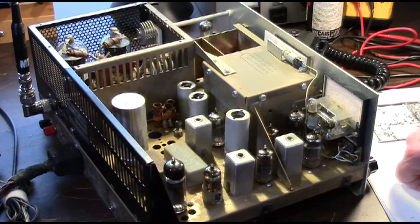So if you're having a mysterious problem where you're not receiving a signal but you're getting hiss, that would be the first thing I'd check — the tube sockets.